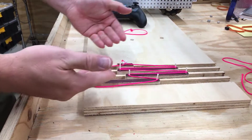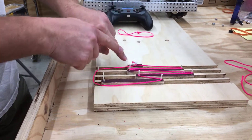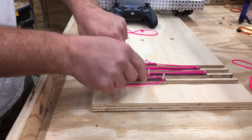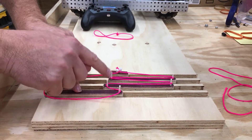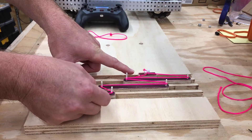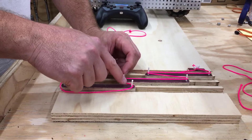You can see these stages moving upward. The stages are going to move based on friction — whichever has the least friction is going to move first. In the real world on a real bot, it's usually going to be stage four. But this is wood, there are splinters, there's a lot of friction. You can see the stage is moving. Two is sort of topped out here — the sprockets are getting close to lined up with one another, and that stage is going to stop moving about that point. Four is trying to kick up a little bit. If I hold three, that'll force four to move up.